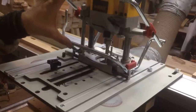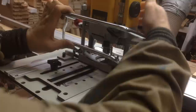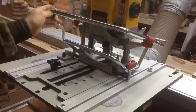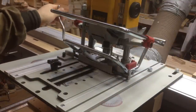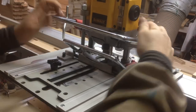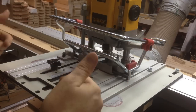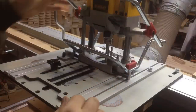What happens is: you turn the machine on, plunge the bar down — I plunge it initially just a couple of millimeters, put the stop on. Then you go back and forth and it hits the stop on either side. Then you go down another quarter inch or so and repeat until you cut all the way down. These happen to be 25 millimeters deep. Then I come up and turn the power off.